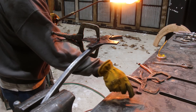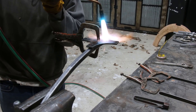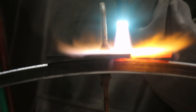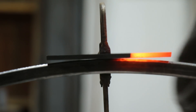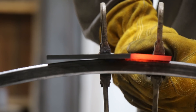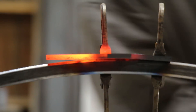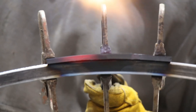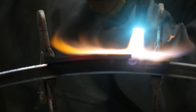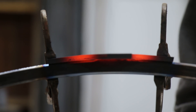The X-plate needed to match the bend of the tubing, and the easiest way I could do this was to clamp it down to one of the scrap ends, heat it up with the torch, and then force the ends down to match with more clamps. Once I had both ends clamped down, I removed the middle clamp and heated that area up, giving it a chance to match the curve too. I let it completely cool before turning it and repeating the process for the other direction.